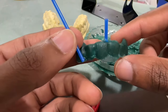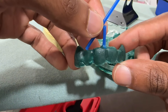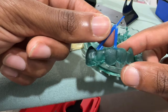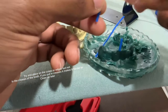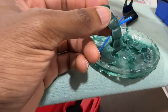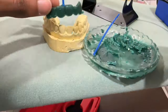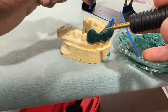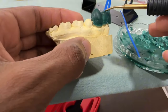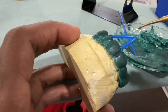When getting your next piece, you obviously want to make it make sense. Go ahead and get your wax sprue again, lean it to measure how long it should be, and then pop it off the way you see me do here. Then do the same process and just melt it onto the wax sprue using your wax pens. Think of it as one wax sprue piece to every two teeth. Since these fangs are bigger, I'm going to reinforce them with another wax sprue just to make sure that the metal gets down to the fangs as well.